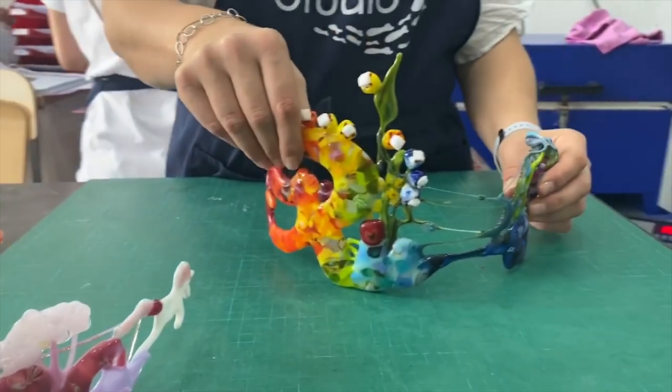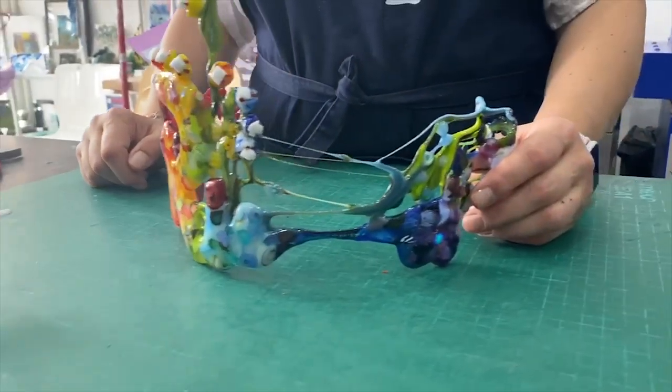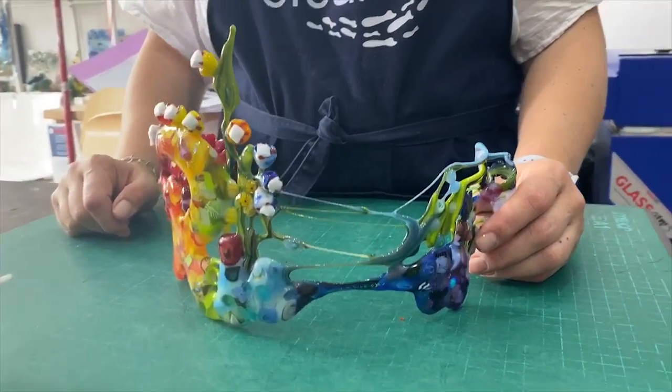Unfortunately, River has totally spread apart. I went up to 680 and I probably should have done it on like a slump of 650. As I said, doing things when you're tired, it's not the best. I will make sure in our firing schedules on here, it's a 650 slump. But again, you need to know your own kilns, know what you're doing in them, because I'm not giving you technical stuff, I'm just giving you nice projects.